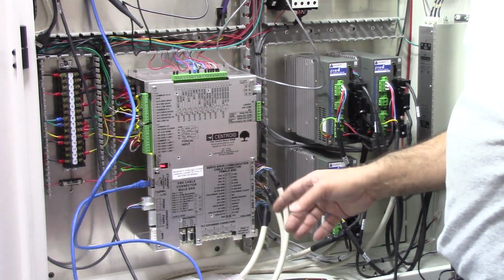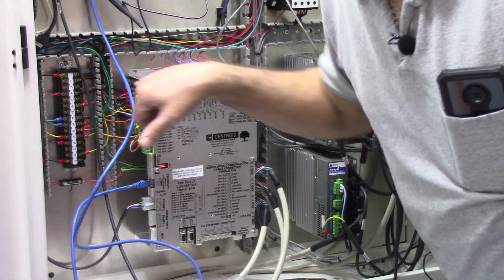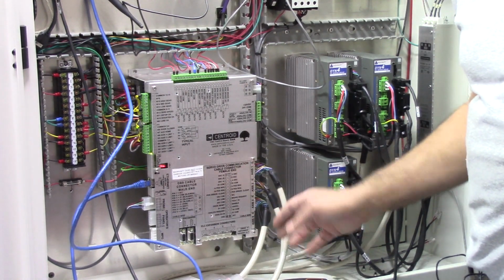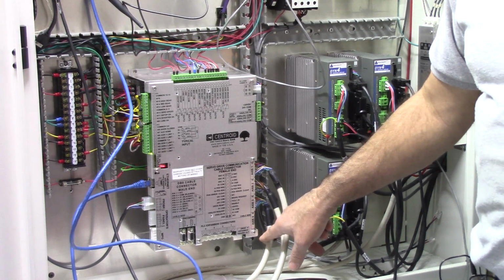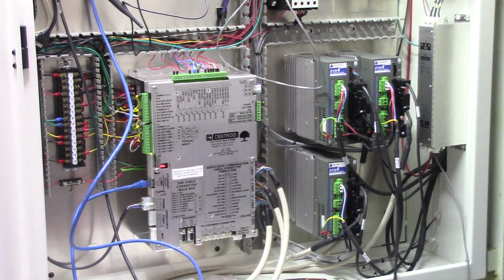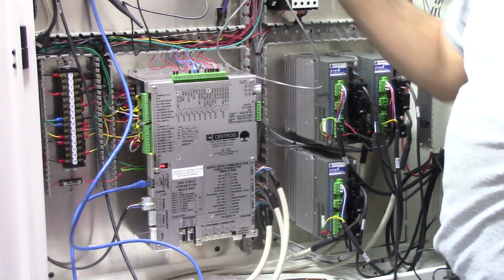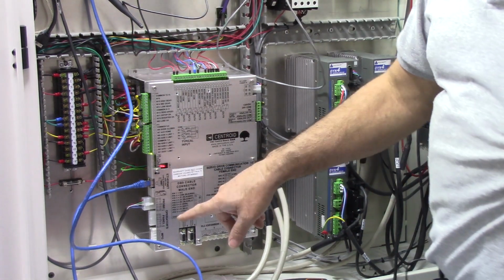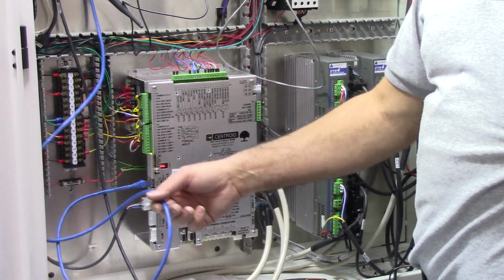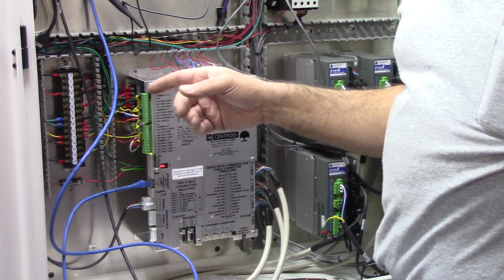Again, here's Oak. The logic power supply for Oak is underneath Oak itself. There you can see it poking out. There's the 3-axis data cables. This machine does not have a spindle encoder. It's not possible to put one on this particular machine, so rigid tapping is out, but the control still controls the spindle drive. I have a probe port on this. When we go to the front of the machine, I'll show you that. Ethernet connector for the shielded Ethernet cable to the Lenovo M92P.